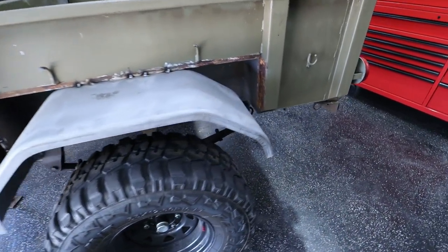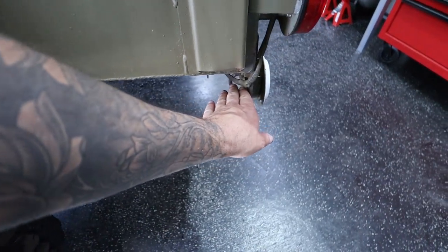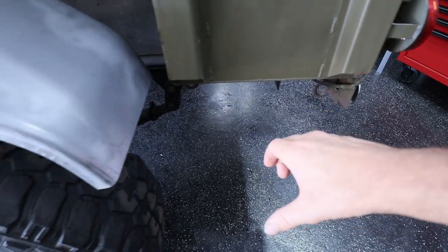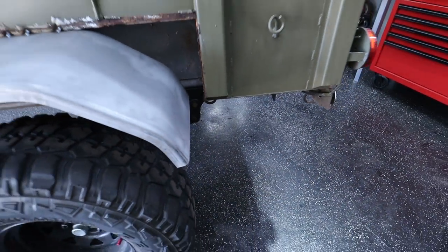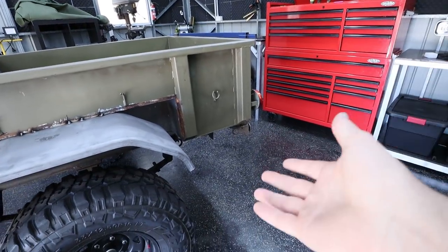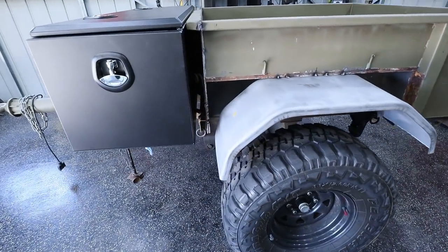And what I'm thinking about doing is actually adding a bit of a slider out of some box section. I bolt it onto there. I can bring it out and around and then weld the mud guard to the box section. Then we can put a plate on top. It'll also act as a step as well as a slider. We'll also be doing one to the front.